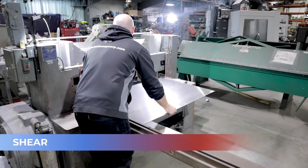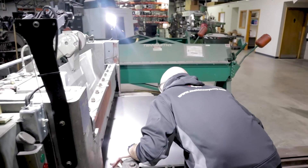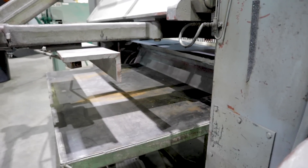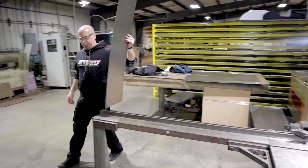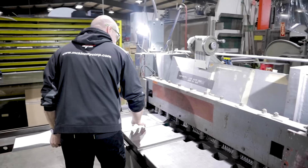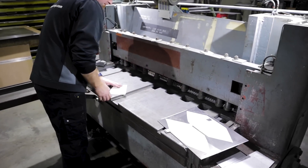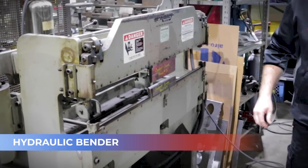I also need to have access to shear every line, because cutting titanium is a nightmare. We're going to be using a shear, which is cold, so it'll shear right through it — like gravy. But if you're going to use a band saw, you need a special blade. Titanium is a material that when you start putting heat into it, it gets harder and starts eating all your abrasives. So I specifically designed this stove so I could shear most pieces.